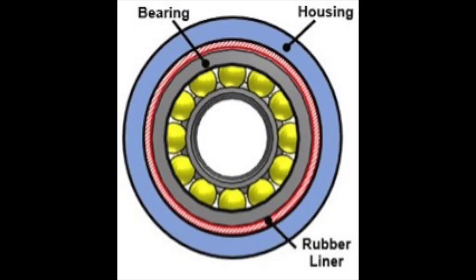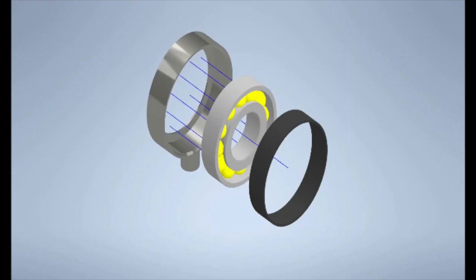MRI bearings range anywhere from 37 inches all the way up to 65 inches, meaning we first had to devise a small-scale assembly to perform our tests. We ultimately created a housing that 6-inch bearings could be pressed into, equipped with an attachment point for the material testing machine after assembly.